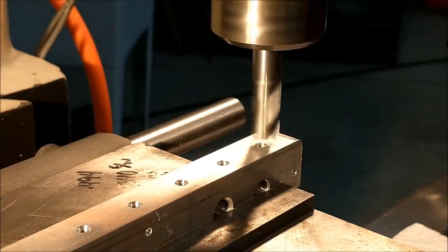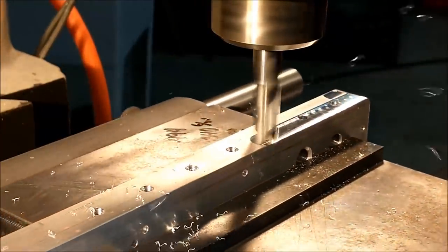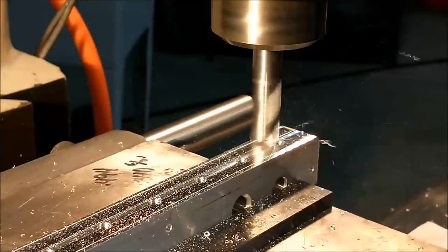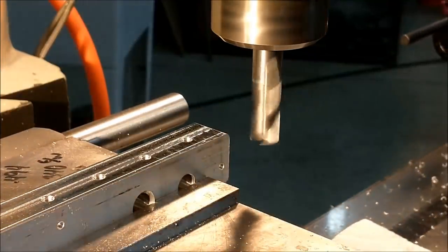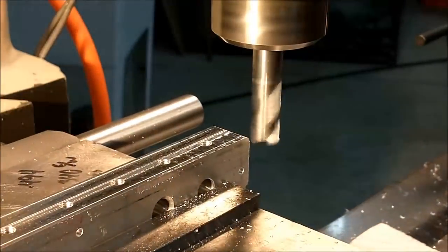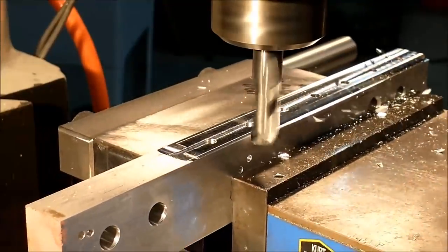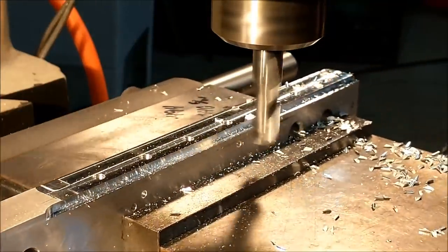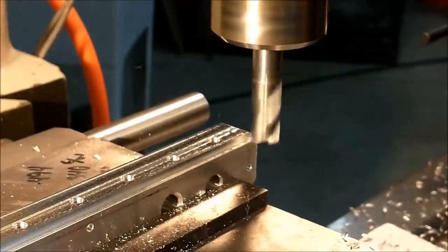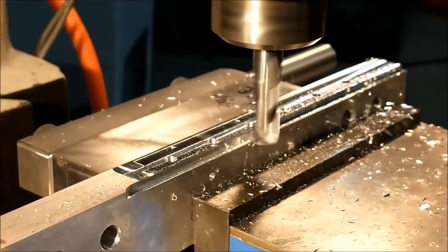Here's a real strong suggestion: when you're cutting the top of a part and using a cutter that's not as wide as the part, make sure the rotation of the cutter drives the cut into the center of the part, then come up the other side and do the exact same thing. This will result in a much cleaner front and rear edge and greatly reduce the time you'll spend at the bench with a file. Any table adjustments for slots and steps, I like to make with the table in motion — in case there's anything going on from the torque of the machine, from the power drive. As soon as I see a chip, I know I'm right where I need to be. I'll set my zeros at that point: one rough pass, one finish pass. This slot is more critical on depth than on the wide plunge, but I'm keeping the width to around 0.125 for a visual reference of where the shaft is when it's seated.